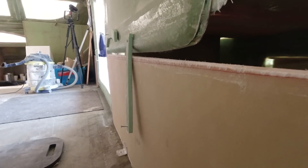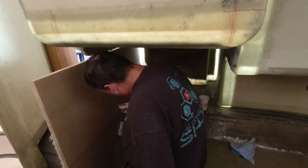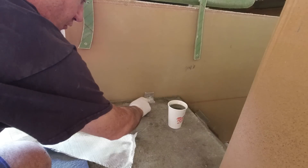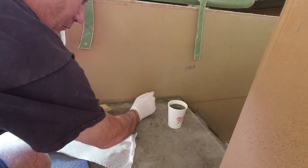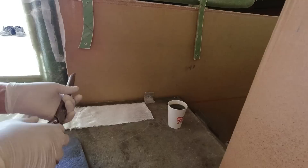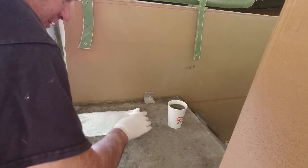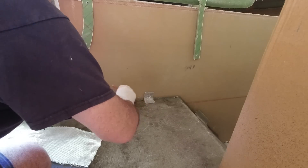The tabbing engages into the fillet, but for now I'm just going to screw it up in place with those two cleats and then backfill underneath to make sure my fillets are complete and the tabbing takes over with the strength. Obviously it's very important not to glass in the bracket because that's screwed in place — I'll tab either side of it, then remove it and patch over the top. I'm placing tabs each side, ever expanding my tabs as I come out — that's sound technique and really the only way to do it.